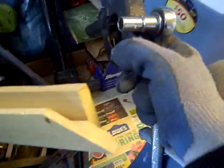Some clamps can help me with that. Well, I know I can definitely work with the riving knife. That's not the issue. The saw is just not straight with the guides, and that's going to make a difference. The saw needs to be straight with the guides at least. Without that, you're not gonna be able to use the guides. I mean, if I make a fence, a sled for it, it's just not gonna be straight.